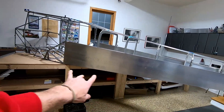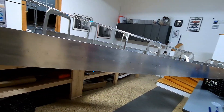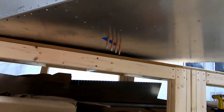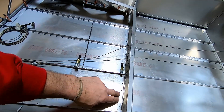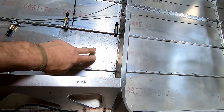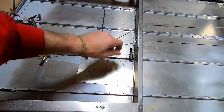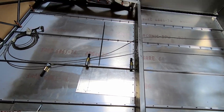The plane sits on the table normally, but I swung the tail end over so I can get underneath. I took four of the rivets out where the doubler is going to rivet on, and right now I'm just trying to match drill the rest of the holes to get them in there.